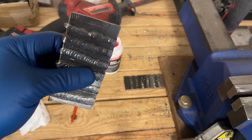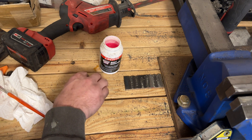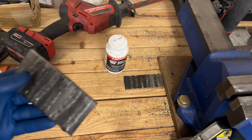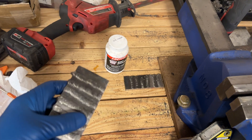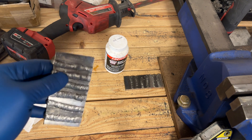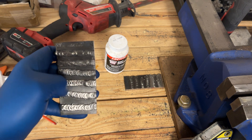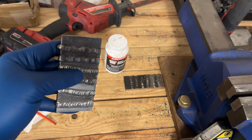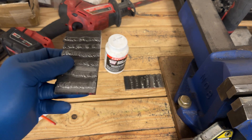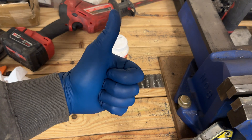Go watch that video if you want to see the actual results. It took about four or five minutes to do this — you now know how to cut and etch your welds. My recommendation is do this so you can see where you're at. You might be surprised, especially you short circuit MIG guys out there. Go weld quarter-inch thick like this without cleaning mill scale and you'll probably be shocked doing a cut and etch at how little penetration you probably have. So there you have it — appreciate you sticking around for the whole video. Until next time.